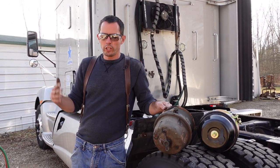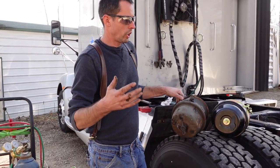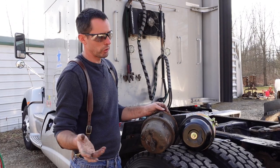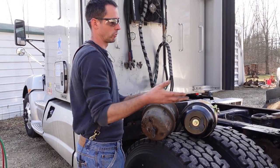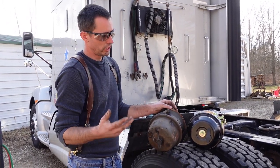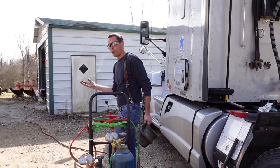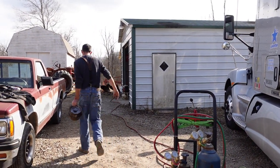So a lot of times if you're going to rely on the shops, I would just tell them, if you got a problem up here, just tell them to change out the piggyback, and that'll save you some labor time, because you're not paying somebody to cut that and change this out when there's nothing wrong with it. There's nothing wrong with that service side chamber. There's no reason to do all that extra work. That might save you an hour's worth of labor with measuring that and cutting it.